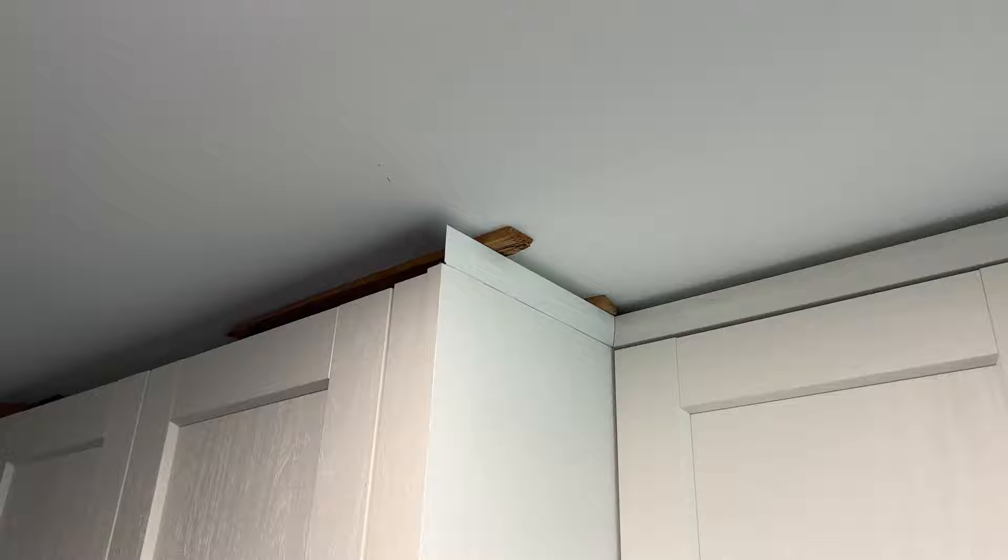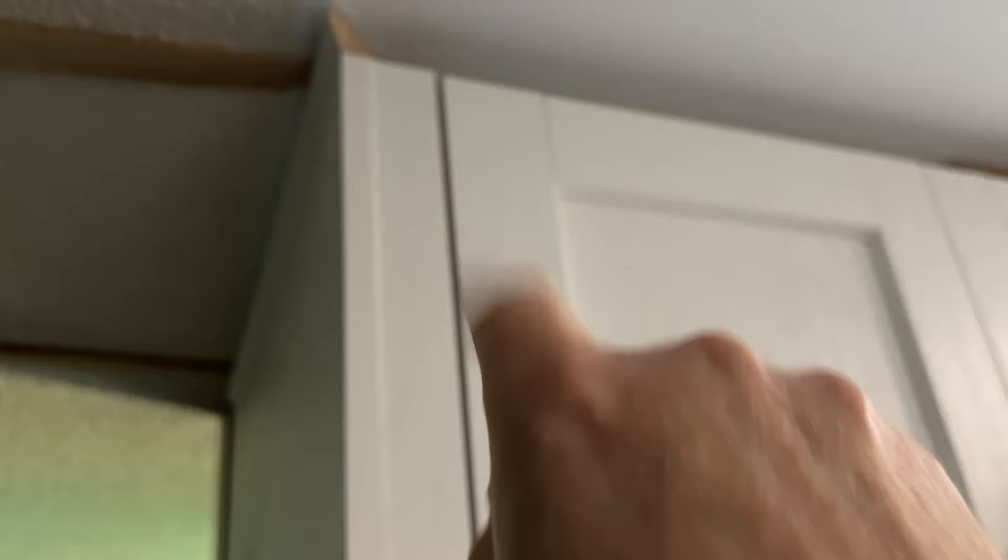You'll also see that I've got some wedges in here. The reason for that is I've got this filler piece in here with nothing on top, so those pieces wanted to fall in, which made it difficult to put those reference pieces in to get my measurements. So what I've done is taken a little bit of white caulking, applied that on the inside, then wedged those shims in place. They hold everything in place until the caulking cures and we can go ahead and install the front piece.